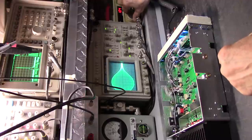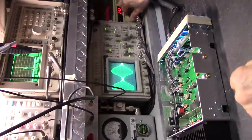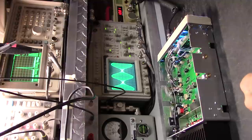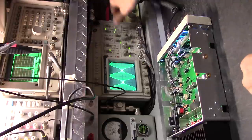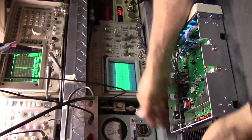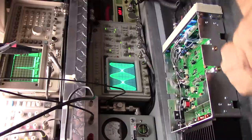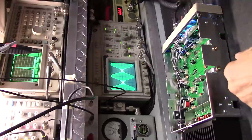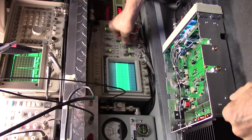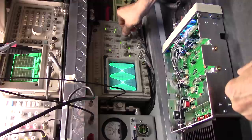Okay. Notice there's no unusual pinching. In other words, it's flat, the continuous power all the way through. Alright, let's bring it up to about 1K again. Doing an awesome job. Wide open. Yes, I've been hammering on it, not abusing it, but let's see if there's going to be any fade to it now. A watt or two. The radio's stroking. I would still run it halfway on the power straight up and down. That's like a 955 out of the box, but these are much cleaner and will run much cooler. There we go. Awesome.